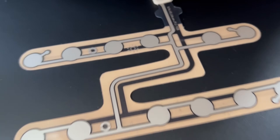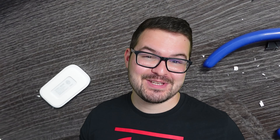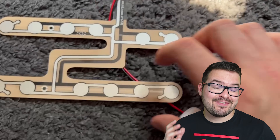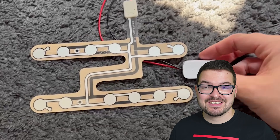This sensor does work as a bed sensor but I ran into a few issues. Due to its small size it wouldn't trigger on various parts of the bed — there's only a set area where lying down would actually register occupancy. Because of its small size it could actually work better as a chair sensor. Another issue was weight distribution across the bed and slats being too evenly spread, so sometimes the sensor wouldn't read. The fix was to place a board or piece of cardboard underneath the sensor so it would always press onto it and register. If you've already got some Aqara sensors, this is definitely the one to start with since those car seat sensors are so cheap to buy.